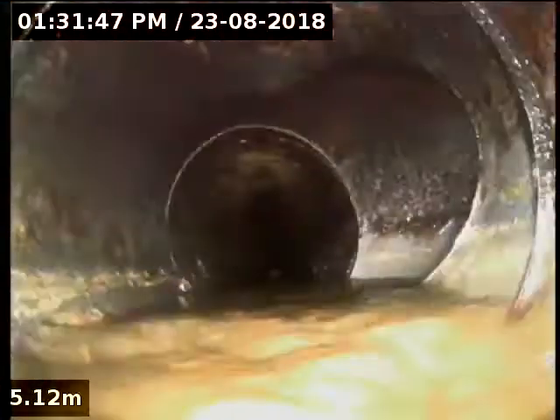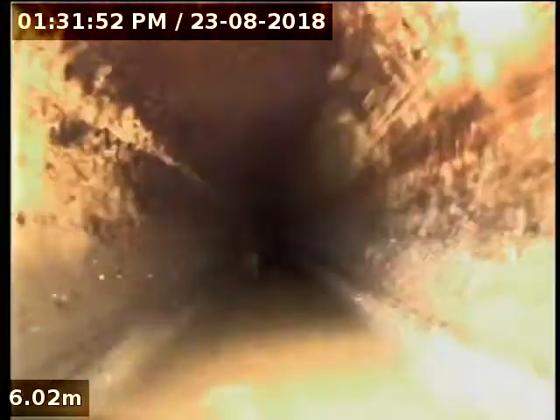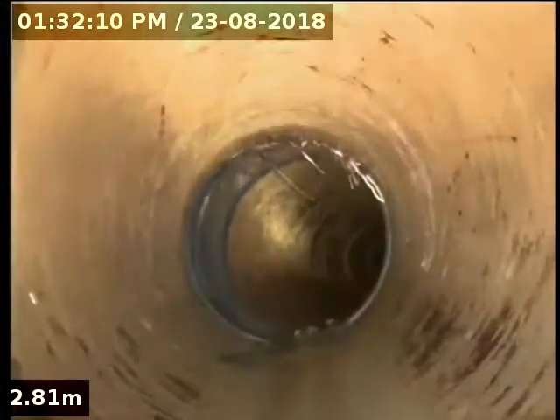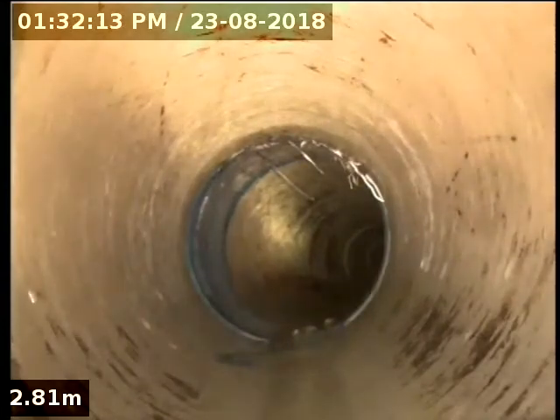So really it's going to need a repair — it'll need digging up through this section here where it's sunk. Probably replacing the pipe from roughly where we come out of the water, then digging back through here to take this belly out, past that junction where it comes from the kitchen sink, and replacing it back to that elbow. That should fix it all up.